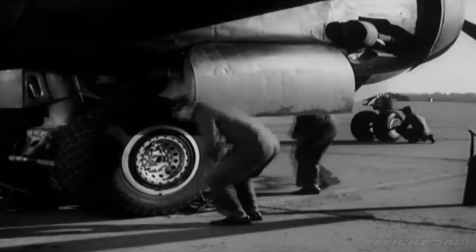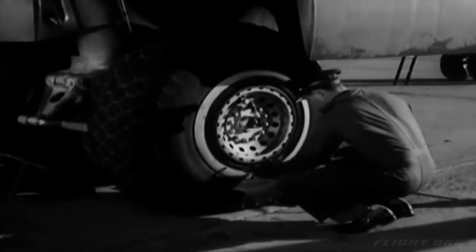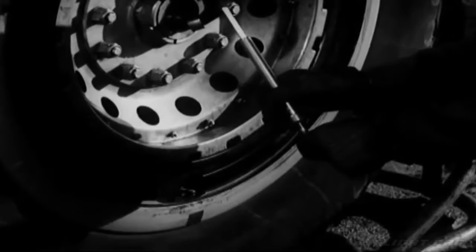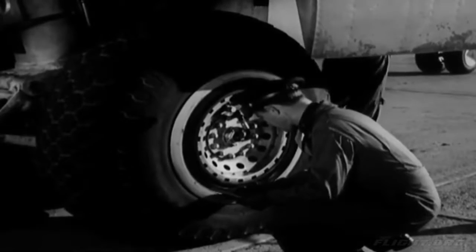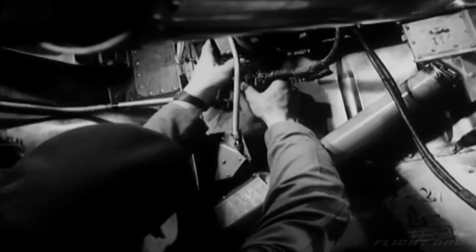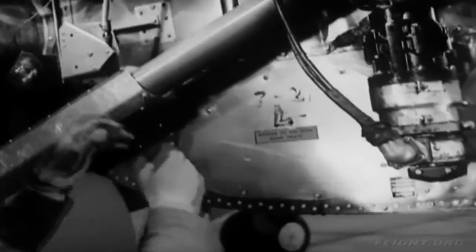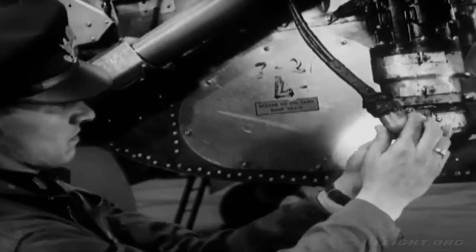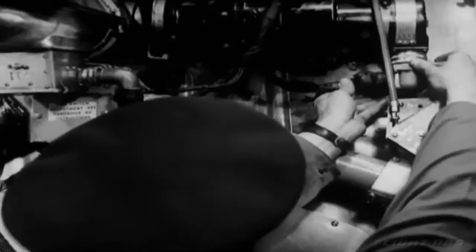The co-pilot ducks into the wheel well to inspect the equipment there, while you work on the wheels. Measure tire pressures again. On these tires, the pressure should be between 75 and 85 pounds per square inch. Inside the wheel well, the co-pilot examines the wires, connections, and switches. He makes sure all the cannon plugs are on tight, paying particular attention to the plugs on this motor, which opens and closes the nacelle doors, and also to the plugs of the normal and emergency landing gear motors.